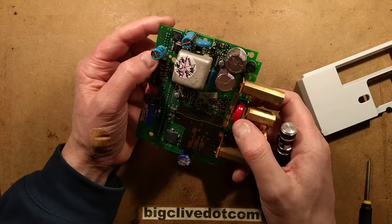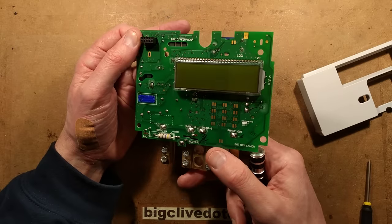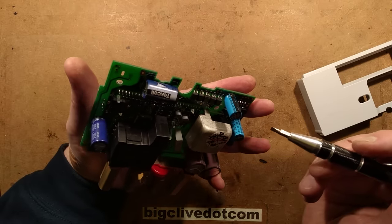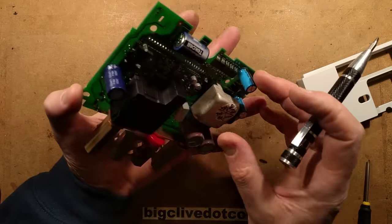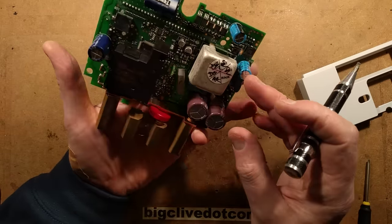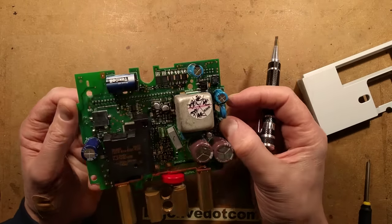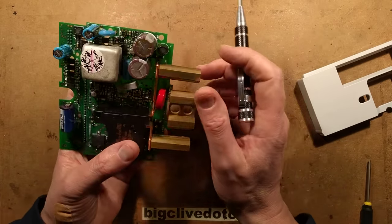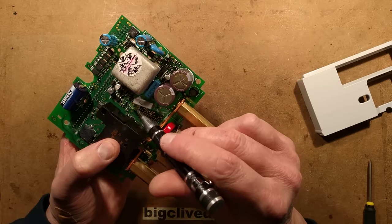Looking for an antenna in the main section - I'd expect something to detect RF jamming. If the meter detects someone applying an external radio signal to interfere with it, it could trigger a tamper event. There are a couple of unpopulated pads here. The board appears to be double-sided or possibly multilayer. The component marked H3 is probably a hall effect sensor - confirming the earlier suspicion.